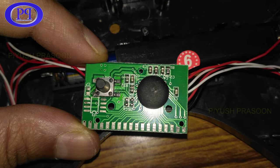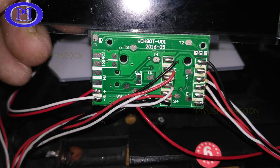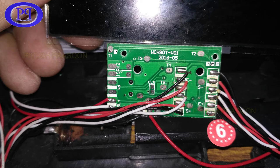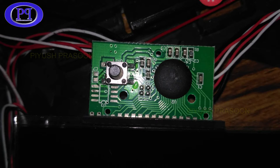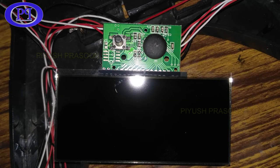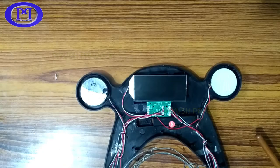This PCB is having chip-on-board technology — you can see the black glob on the chip. This is the microcontroller which has the memory. It is a temporary kind of chip — if it gets burnt you need to change the entire PCB; you cannot replace the microcontroller alone. These are the wires coming from each load cell stress sensor, soldered to the PCB. There is also one tactile switch on the PCB just for changing the measuring unit like kilogram to pound or vice versa. The display panel is attached to the PCB with fingers.